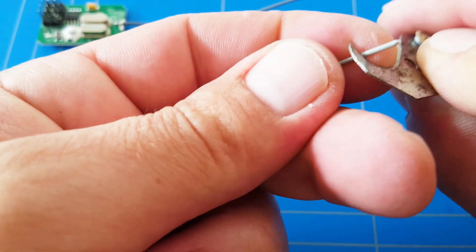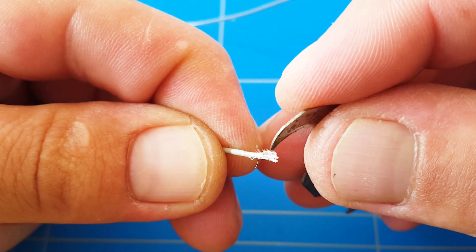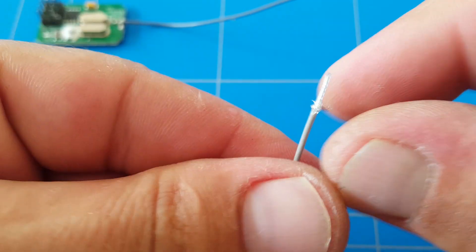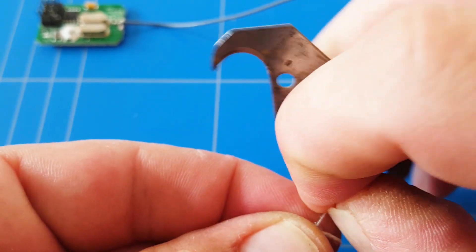It's pretty easy and simple. The first step is cutting off the apex connector, then we're going to remove the first layer of protection and peel back the wires and bundle them up together, then go to the inner wire and open it up a little bit at the tip and pre-tin them.